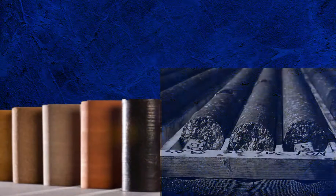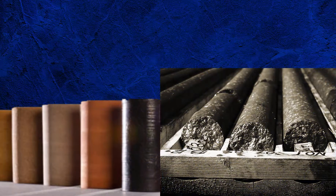Strictly speaking, these should be considered more plugs than cores. There are two main reasons to take sidewall cores: first is to sample formation that has not been cored, and the second is to take samples of formation where the core has been lost, for example where soft formation has been washed away or jamming has occurred and the core has been milled away.